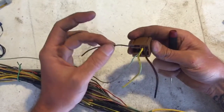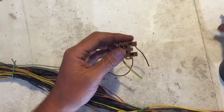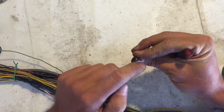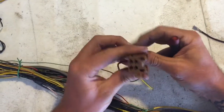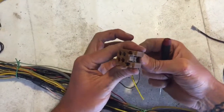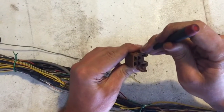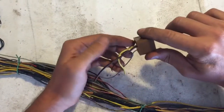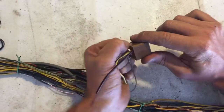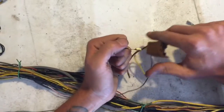Let's take a look at doing one of the small wires in the valley of the actual wire connector — the little area in between the two round portions. We're going to want to push the wire up as much as possible and then take a small screwdriver and fit it in between the valley at an angle and try and pry a little bit, and then we should be able to just pull that connector out.